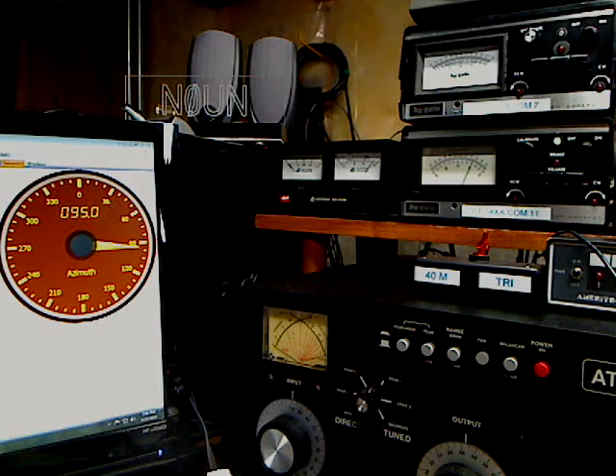Do another one here. We'll go up to, say, 30 degrees. With one click of the mouse, the rotator will wiggle right, unlock, automatically turn to the left, and start rotating. As it comes up on 30 degrees, it'll coast in. And then five seconds later, the red light will release and the brake will engage.